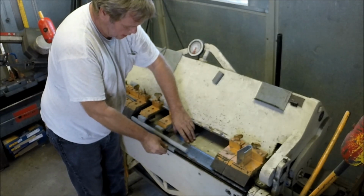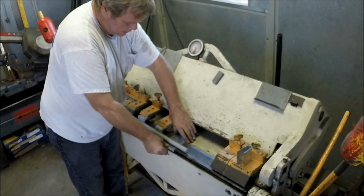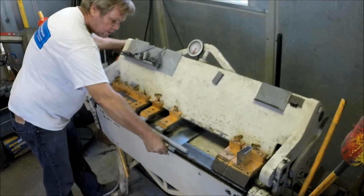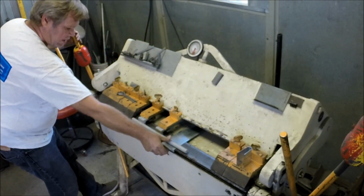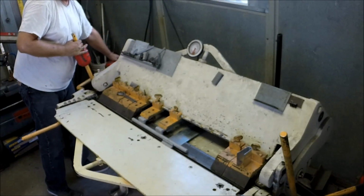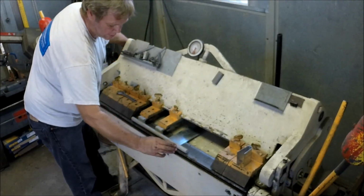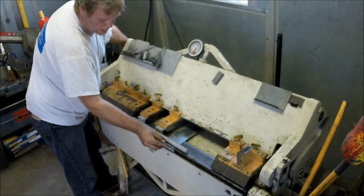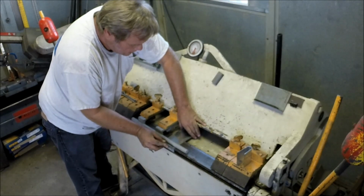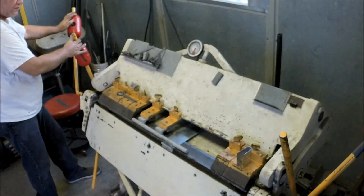So we're just gonna kind of square up, eyeball. I'm gonna go about 2/3 of that apron die. And hopefully I get a good pinch on this thing. Yeah, it feels like it pinched down pretty good. And I'm just going to give that a gentle roll. And looks like we got that up to about 90. We'll pull it out again. Square up again. One more time.